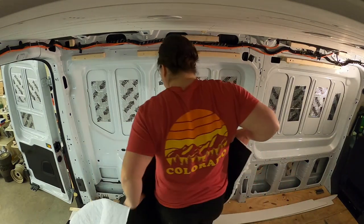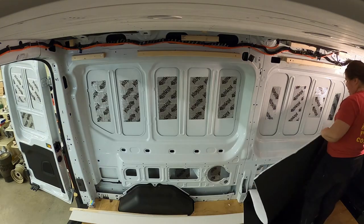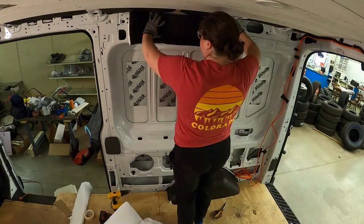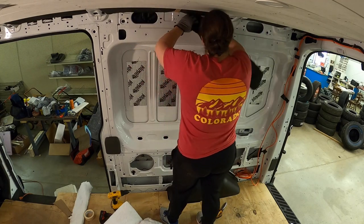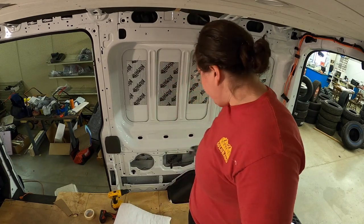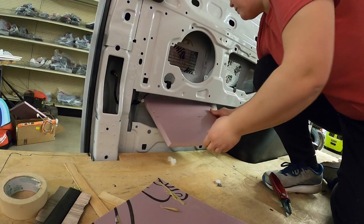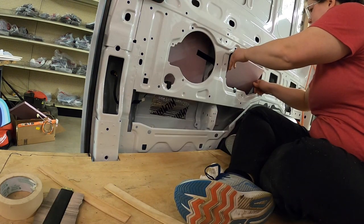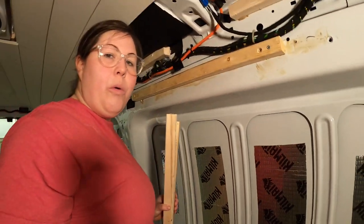Okay, long sleeves are off, ready to work. Looks like I filled all those gaps. Now I have enough insulation to work at least a little bit on the lower section. I'm switching tasks because I'm on my last tube of adhesive for the day. I'm going to use support boards along the wall here and over there to hold the wall up, to screw the wall boards in and create enough space for insulation.